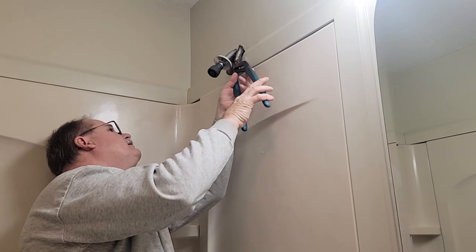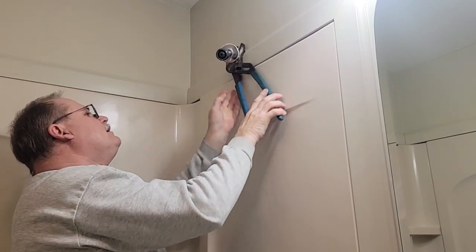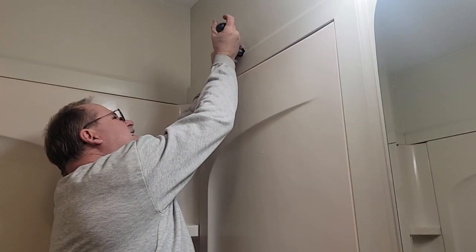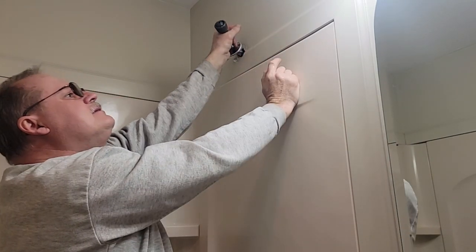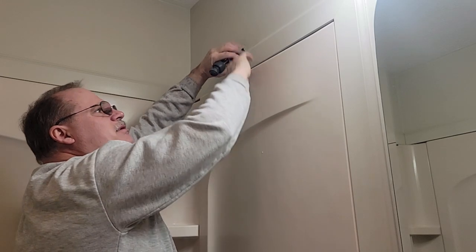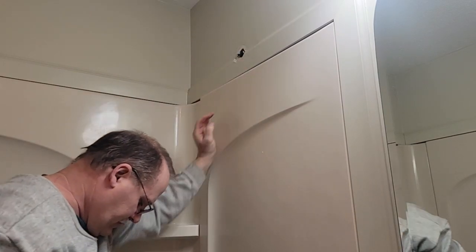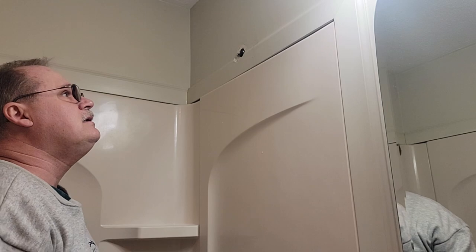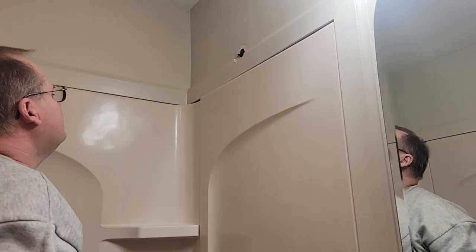Get her to turn half a turn. And then this is baseboard — colonial baseboard — put on there to cover the lip of the shower, probably rather than re-drywalling the whole room. We'll get a new escutcheon plate together. So that's done — that's brass in there, so I like that. Now we got to get a utility knife to cut all this caulking, pry bar, probably a putty knife to lean against.